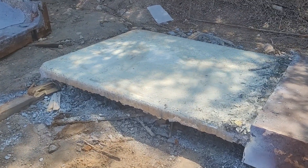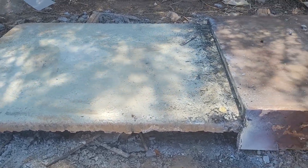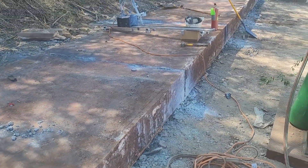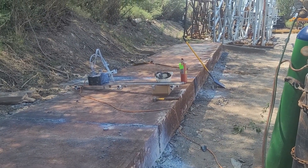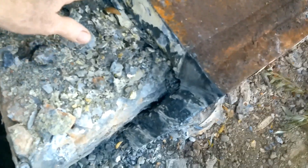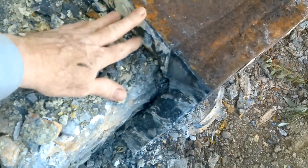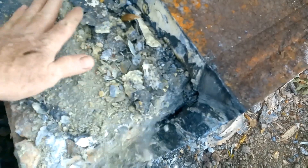This is what the zinc looks like down at the bottom of the kettle after the section of metal was removed. I have to go and finish the entire bottom, 46 feet away. The challenge we're up against is we have two inches of the actual kettle bottom right here, but then we have about four inches of all this zinc right here.